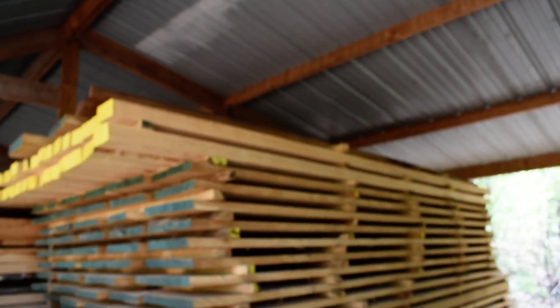In the future, since I'm milling my own 2x4s now, I'll be building another shed here coming up in about two months for beekeeping. When I do that video I'll probably put it on time-lapse, but I'll be building it with 2x6s as opposed to 2x4s and I'll span 24 inches instead of this maximum span of 3 feet that I've got here.